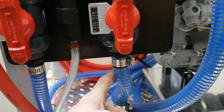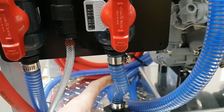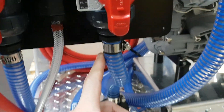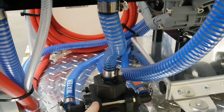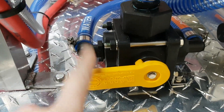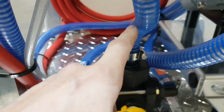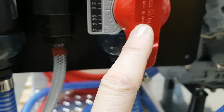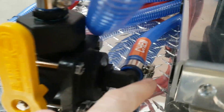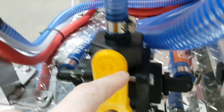This is your bleach line right here, bleach valve. This runs to the manual flush valve — so the bleach metering valve goes to the manual flush valve. One side is the water connection, the other side is the bleach connection. When the valve is in this position, it is drawing water through your bleach valve, flushing or rinsing it. When you have the handle in the up position, it is drawing bleach through this valve.